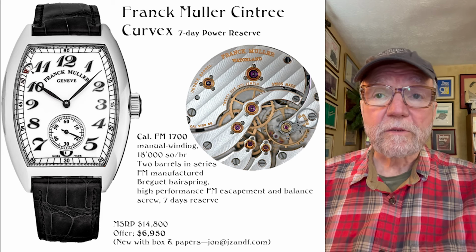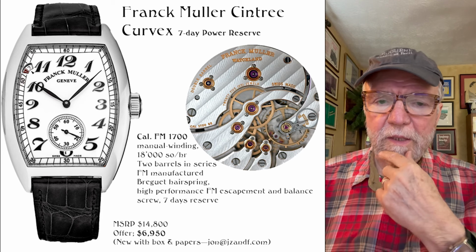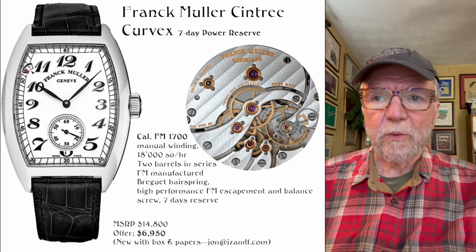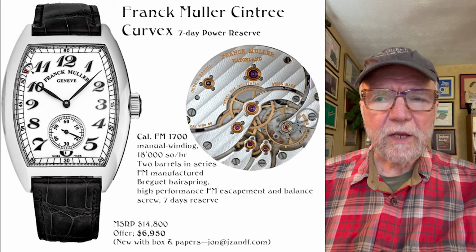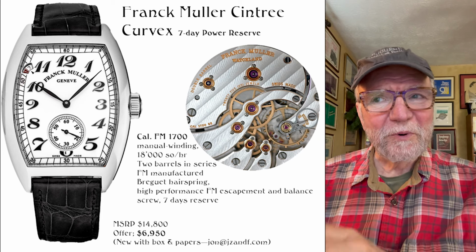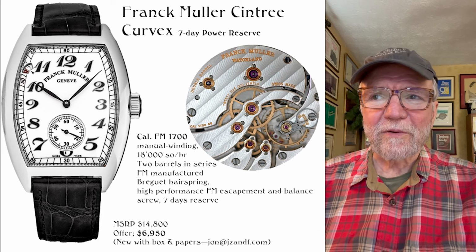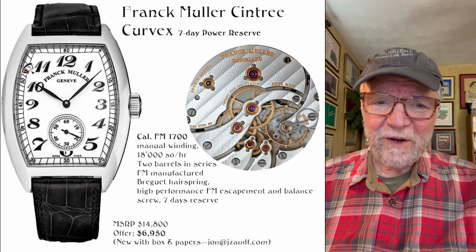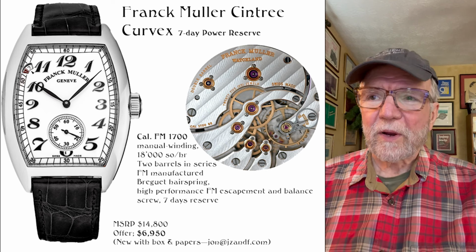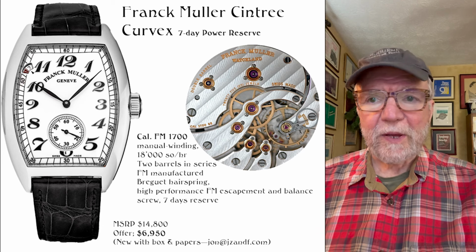It's got two barrels, but they're in series, which means one goes and the other one kicks out. The Nomos Lambda we just looked at also had two barrels in series. It's got a Breguet hairspring, and I'm not quite sure what that is. It's not the new Breguet hairspring. You can see it has a very interesting-looking woodpecker regulator, which is a type of swan neck regulator. 7-day reserve. Man, this is a nice watch.